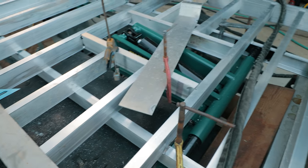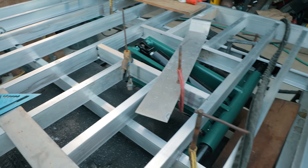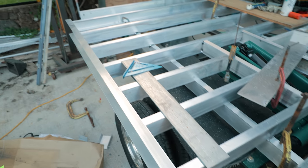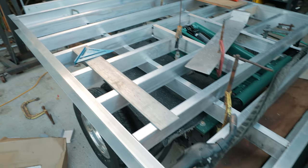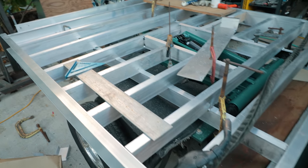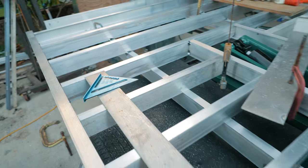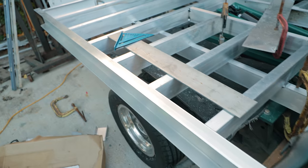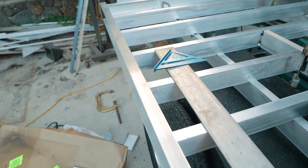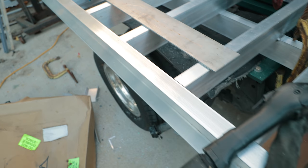Short joist is cut, cross members 30 inches right there to right there. Boxed in the scissor assembly. Space everything under 12 inches to keep everything nice and flat when we put the decking on, and strong. No hollows, only tack, tack, tack here and there. No need welded out solid yet. And we want to keep everything straight. We don't weld anything out yet, because we'll create shrinkage and warpage where we don't want it.